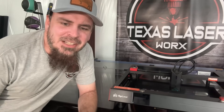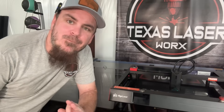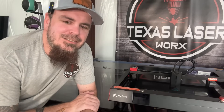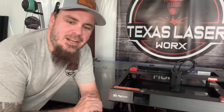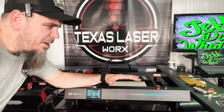This machine also has a lens cleaning reminder, flame detection, air pressure monitoring, and a lot of other safety features to help make your job safer. It uses second-generation COS technology that polarizes the beam combination to improve performance by 40 percent — a huge difference compared to regular 20 watts, especially for deep cuts on acrylic or metal engraving. The spot size is 40% smaller: at 3% power you're at 0.06 by 0.05 millimeters, and at 100% power you're at 0.16 by 0.14 millimeters.